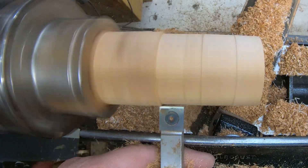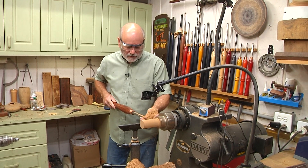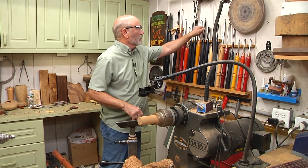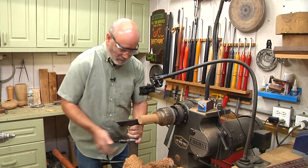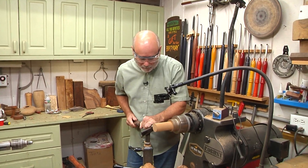Now this doesn't have to be pretty, I'm just roughing this out quickly. And I should be able to make three of my little supports out of this one piece of wood. I have a fat spindle gouge here. So I'm just going to come across here — let me adjust this a little bit. I'm going to put the tool rest at the angle I want to make my little pyramid at.